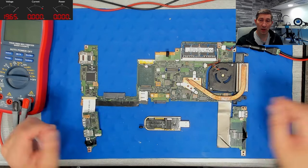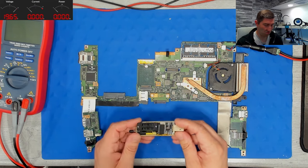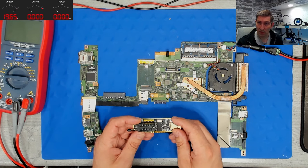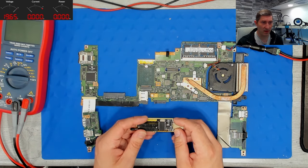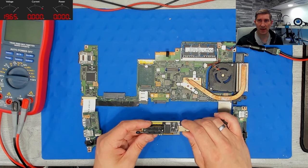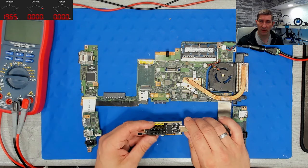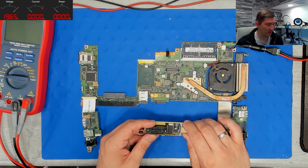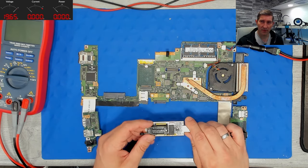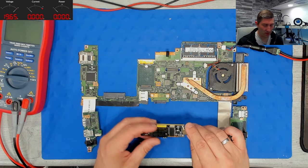This is a cheap CH341A programmer. It costs around $15 at Amazon, for example. You can, of course, also work with other programmers, like the TL866 or RT809F, or even a Betronics programmer. But if you don't plan to program more than BIOS, like microcontrollers, for example, or even more weird stuff, then this cheap CH341A programmer is absolutely everything you need.